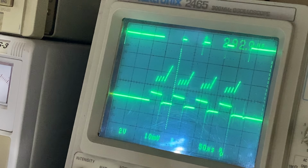I really wanted to run a separate supply with a fast inhibit on and off, but a lot of people want to put soft start in their power supplies these days. They think they're going to be switching 100 amp loads or something, and they don't want a super hot start on it. And on this, who cares? You're dealing with maybe half an amp, or not even that, 200 milliamps or something. And you want to just go smack on, smack off, really hard and fast.